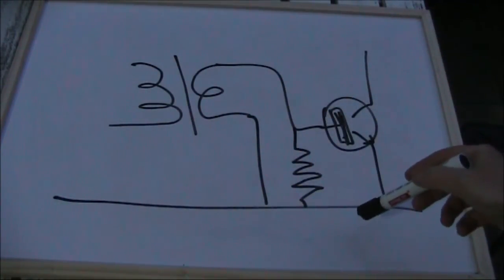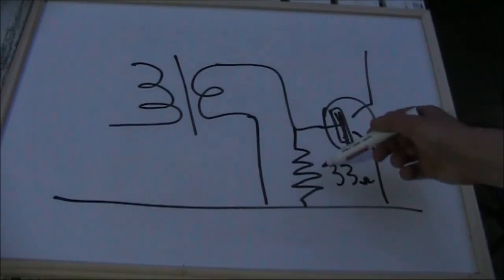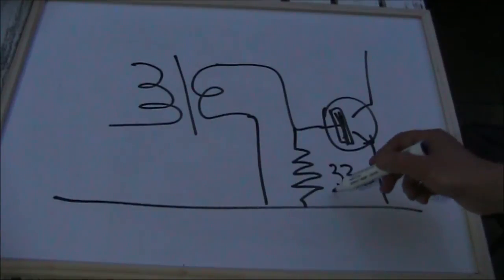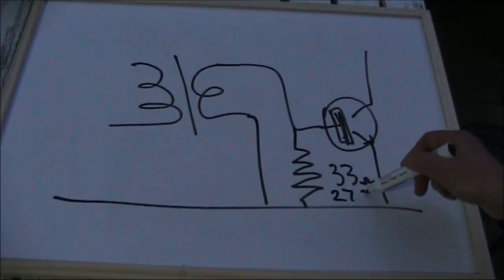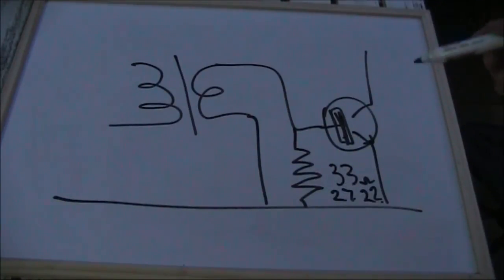You may have more gain than is required. The transistor might put out more than its rated power, get very hot, or have oscillations on other frequencies. So you need to tame it. One thing you can do is drop the value of this resistor — it might start off at 33 ohm, but you could substitute 27 or 22 ohm. There's a lot of cut and try when modifying things to different bands.